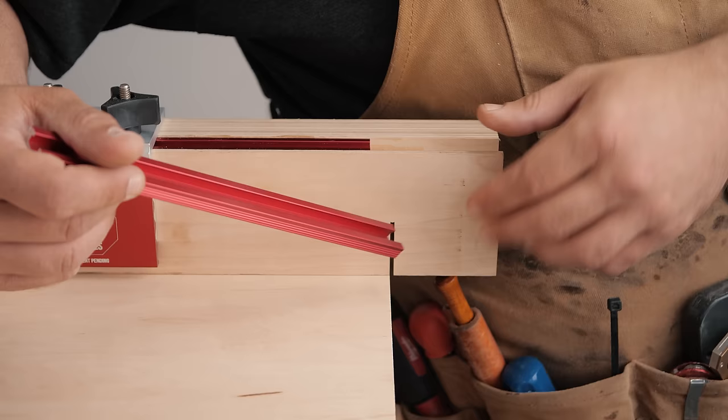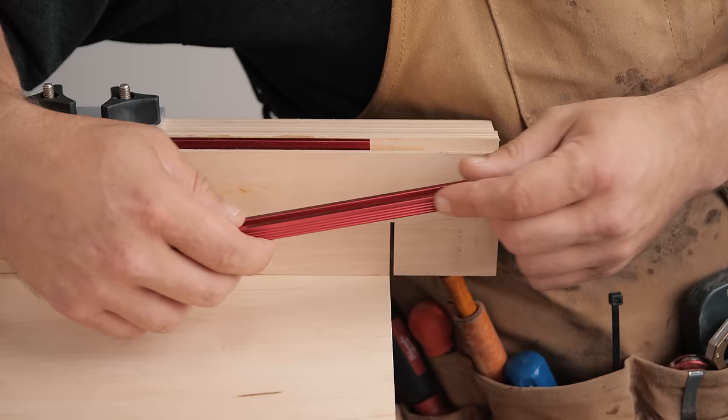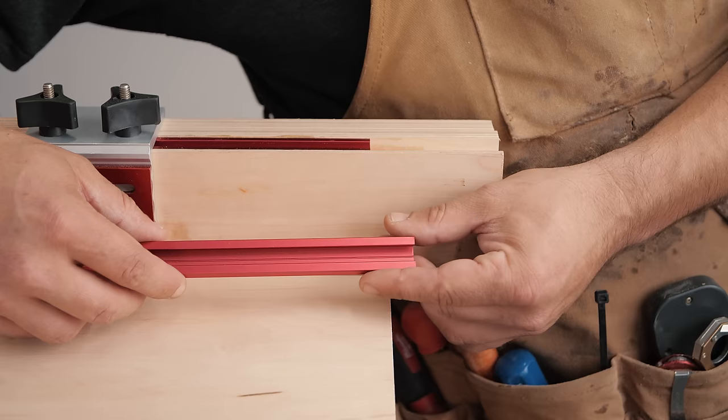And this is important if you have a SawStop. Aluminum can be cut by any woodworking tools. In fact, at the end, I'm gonna just trim this off with an old Suizan Ryoba saw I have. But you don't want to have your SawStop trim your aluminum by accident. So make sure that when you glue in your track, you're putting it an 1/8 inch away from where your kerf is gonna be, because that can set off your SawStop brake cartridge.